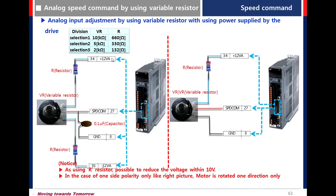Here is the resistor selection — you can choose anyone. If you want plus minus 10V wiring, use pin number 34 and 35. If you need plus 10V only, wire pin 34 only.